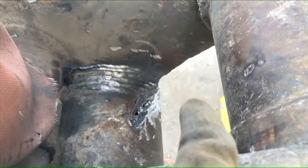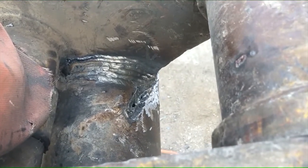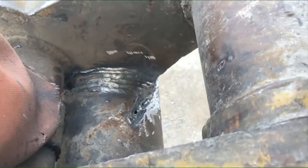That was an already-fixed repair right there — a previous repair that went all the way up to there, but it all spider-cracked out because it was only half fixed. I'm ending up putting so much weld down and taking so much time because the last guy that was coming around — they said when he'd come do a repair, he'd show up and be gone again in an hour. He was just grinding down a little bit, putting a little weld over the crack, and taking off. So now there's weld on weld on weld, and none of the cracks are repaired properly — there's spider cracking everywhere.